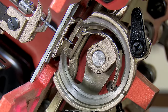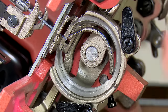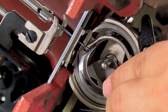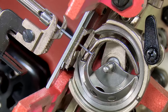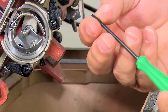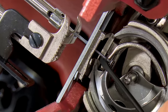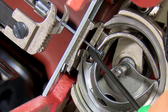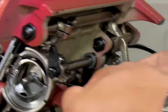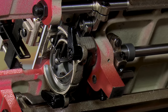Now to reset this — we have to move it back and I've got it loose enough that I can move it. Sometimes these are quite tight and you may have to tap on them with a screwdriver in order to move them. I've got it back. Now I'm going to put the hook in — notice where the hook is. The smaller screwdriver that you get has a point width of about 3/16ths of an inch, and the hook point should be 3/16ths to an eighth of an inch back. I can use it sort of as a feeler gauge — and you can see that right there, that is pretty much perfect. I'm going to come in where our set screws were and snug up one of those screws — not set it really tight, just snug it a little bit so I can always make fine-tuning adjustments.